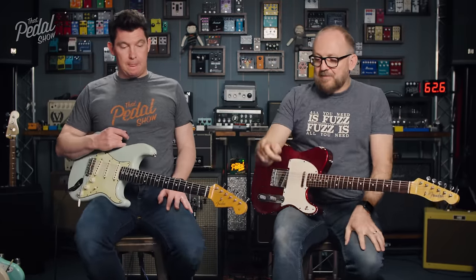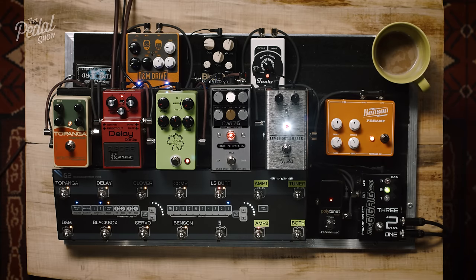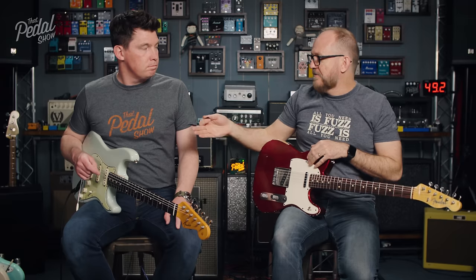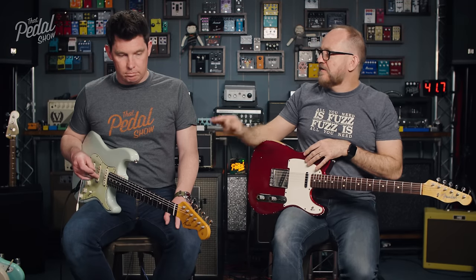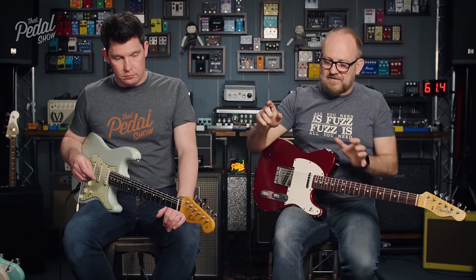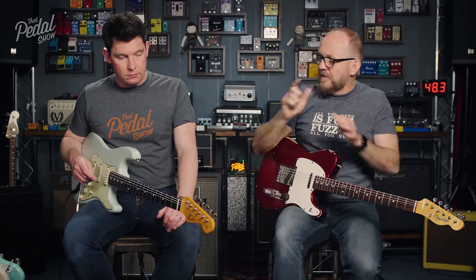What this buffer has is this little high frequency control. It's really handy if you're doing things like changing guitars. You're going to play your Strat for 60-70% of the gig, but for those couple of songs where you want to use a Les Paul or something that's perhaps not as bright, to save you having to change the characteristic of the amplifier, you can just tweak that. The idea of that buffer is that if we were getting tone loss, which we're not, it would drive all that, and happy days.